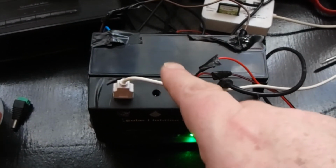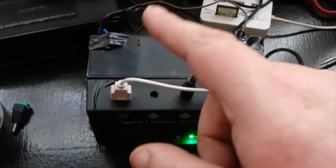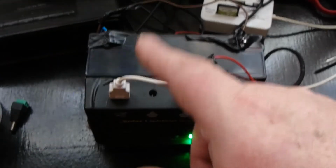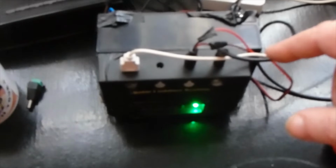The next time I'm getting my new battery through, they'll be doubled up. You've got to keep the same type of battery. If it's a 14 amp hour, 6 volt battery, you buy exactly the same one again when you're making them into 12 volts. And you run that in series when you're doing a 12 volt system. And yep guys, 12 volts is much better than the 6 volt.